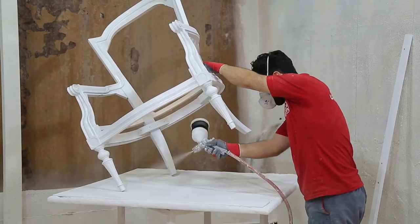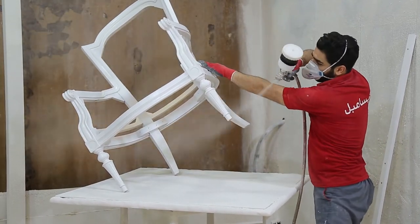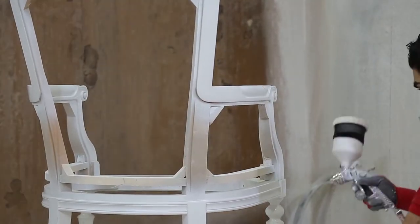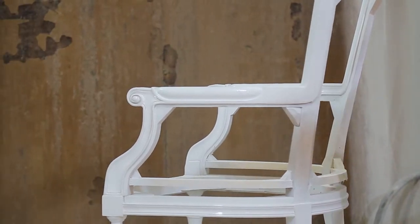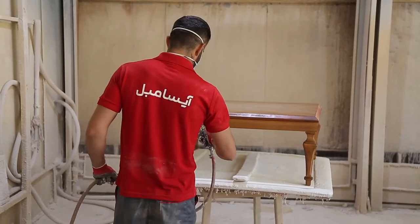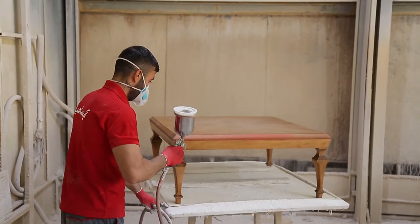The second subdivision is applying the first layer of primer to the wood. A priming paint has a high solid content that fills the grain in the wood, making for a smooth finish. A primer also seals the absorbent bare wood, preventing the painting coats from sinking in immediately. In the side booth, we use another type of primer — a sealer — depending on the final painting required.